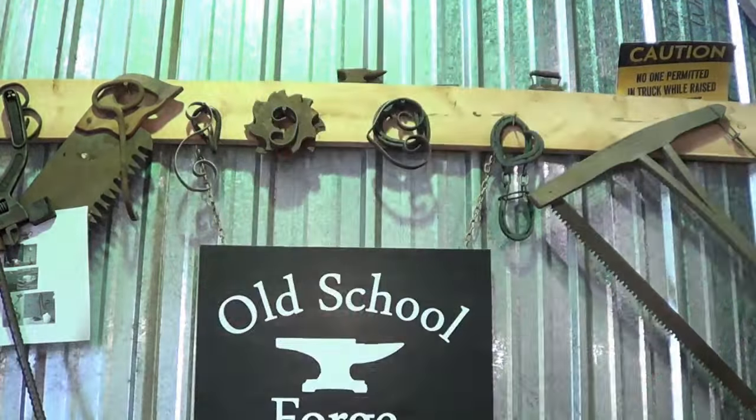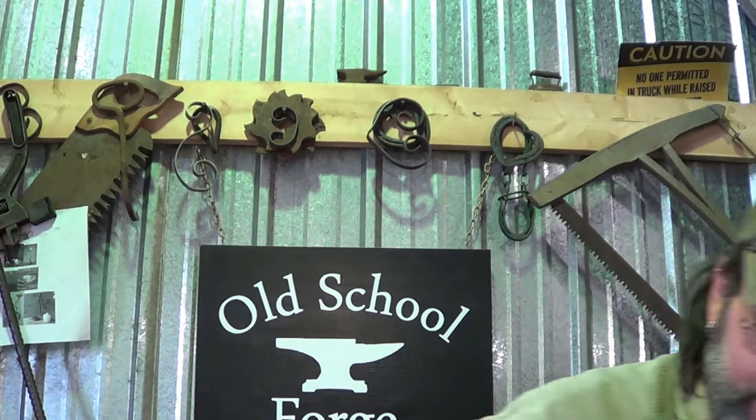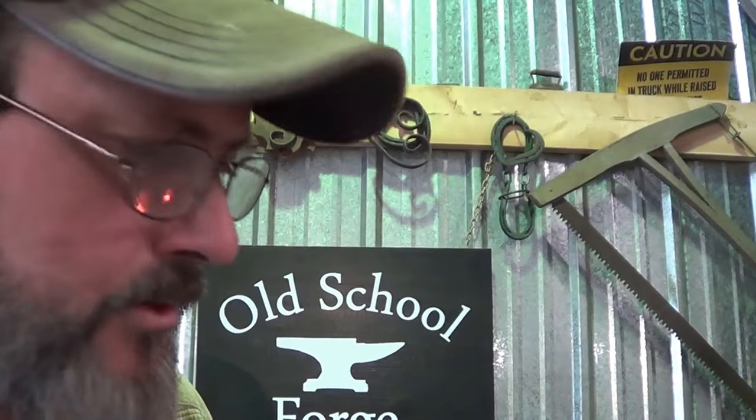Normally this is where I go through my test. I'd have a little piece of that steel, a little extra, and draw it out and do the old breaking thing. And I actually have this piece. I wonder if I should do that before I freak something up. We'll call this a normalizing section for the blade. And I'm gonna go ahead and draw a piece of that stuff. Let's see what we get. We'll go through my tests, I'll come back. I won't bother showing you again. There's a couple videos of it.